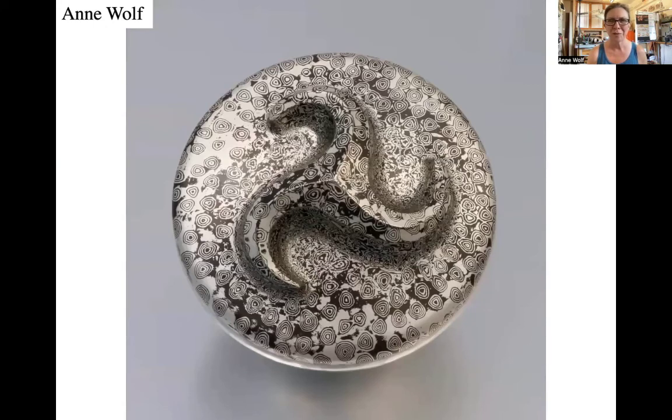This is a piece I made when Ford Hallam actually came out and taught a class in my studio in 2018, roundabout there. And the uchidashi, the Japanese technique of pushing down the metal. So it's technically chasing, not repoussé, although you repoussé once and then you chase, basically, but it's different, as Ford would say very strongly. It's not chasing and repoussé, but it's the same idea of pushing up and pushing down. And so I thought, well, let's try it on Mokume. And it's really fun, but it does mess the surface up. You can see that the patterning is quite indistinct because of how much the metal is being squished and moved around. And I don't think I would be able to even get below that turbulence. I'd have to really scrape and sand quite a bit, and I'm not sure that it would be useful, but it was a really neat project to do.